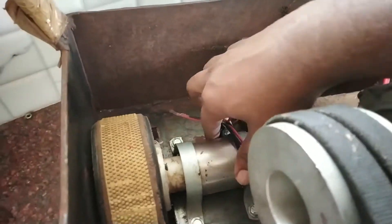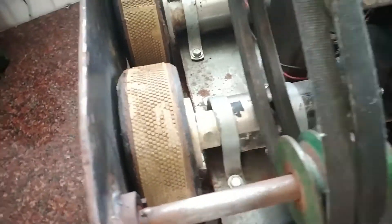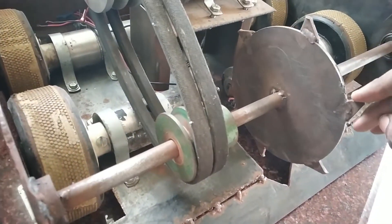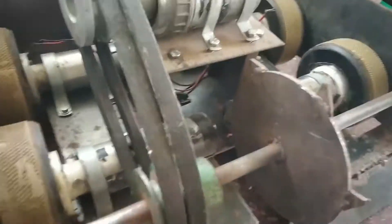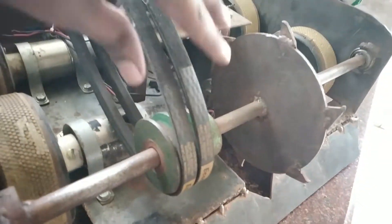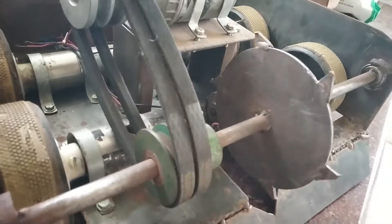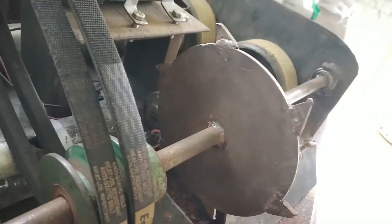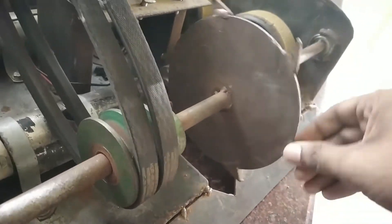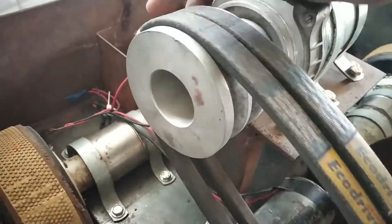This is our Mark 18. I have made a lot of new upgrades — before it was around 50 kg and now it is around 40 kg. I reduced the weight a lot because I was facing power loss problems during fights. This robot is equipped with four high torque motors for locomotion, placed with clamps very tightly. We also have a 24 volt motor for the attack, which is a vertical blade system. The blade has sharp teeth to crush the opponent's bot, and the mechanism is belt-driven. The rotating rod's ends are welded with ball bearings to ensure rotational motion.